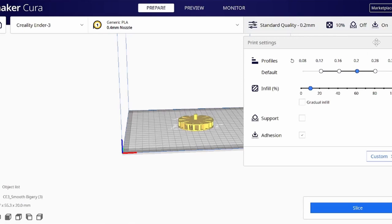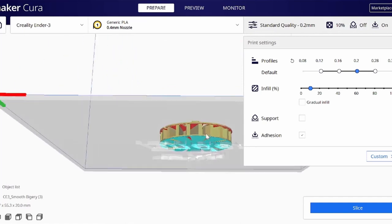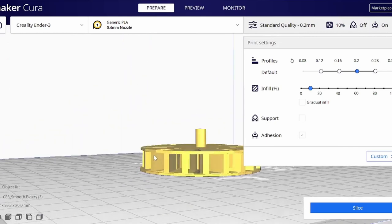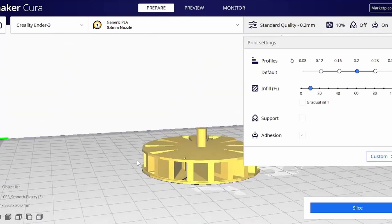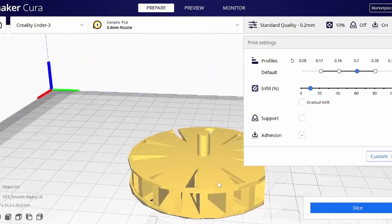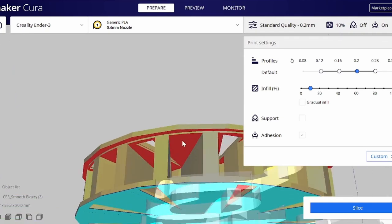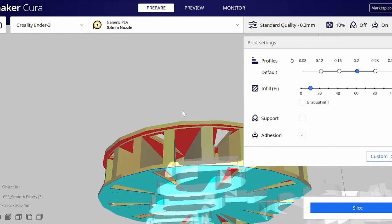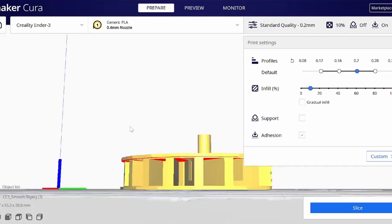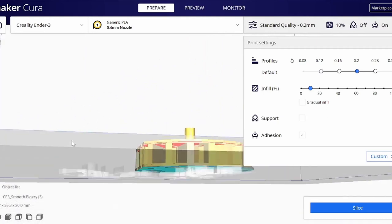The process is not super difficult and Cura has many settings you can play with, with more in custom mode. Basically, you want to make sure your bottom is all blue, because that's the foundation — if anything is not blue there, that's going to cause you problems. Anywhere you see red is a potential problem because you have nothing for that layer to print on top of. You've got to hope that the area is small enough to adhere without caving in — it did pretty much for the most part. Here's the finished product.